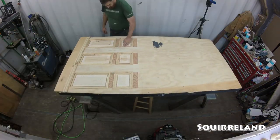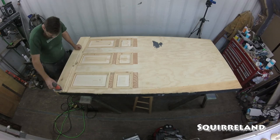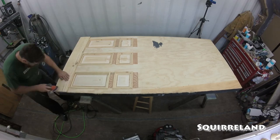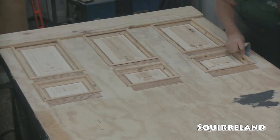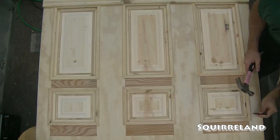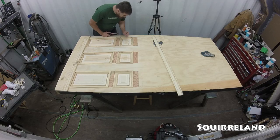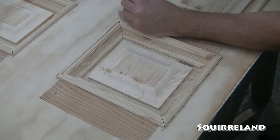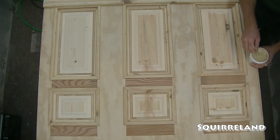With all of the decorative pieces attached, it's time to flip it over and start prepping for the wood stain. That means sanding — lots and lots of sanding. It's the most thrilling, and basically everyone's second most favorite part of my videos, just behind endless hours of watching me paint something several coats of paint. Is that foreshadowing? Take a guess. I also went over the whole panel, sunk down any finishing nails, and applied putty to any nails, cracks, or seams that I felt needed it.